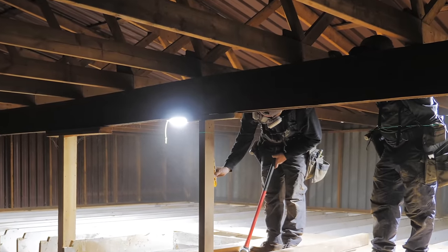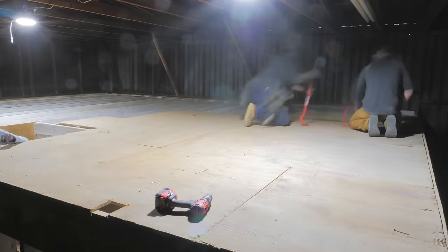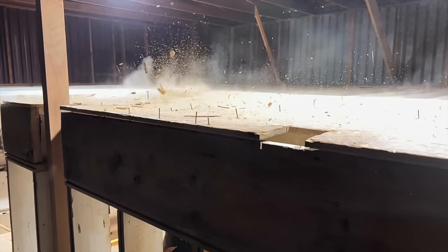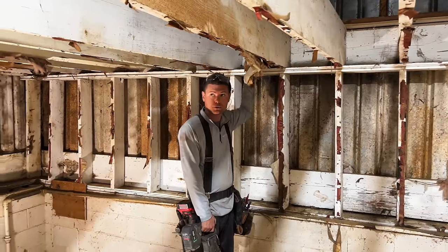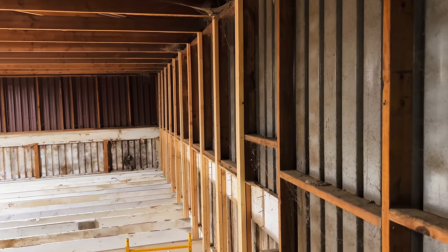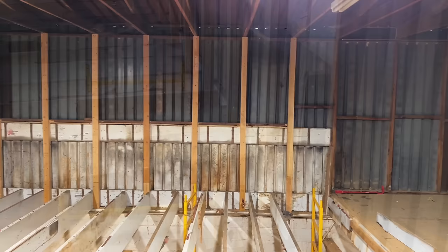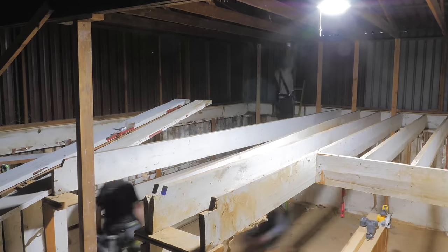We repeated the process to install the other post, then got the rest of the plywood removed. Once all the plywood was removed, we needed to deal with the wall framing — we had two wall sections that needed to be spanned with some kind of framing to tie them together. The Perkins Brothers' solution was to add an inner piece spanning the two existing rim joists, bringing the material flush with the studs in the upper wall section, then tying the two sections together with one long stud. As we finished the wall framing, we could start taking down the joists since the walls were now braced.